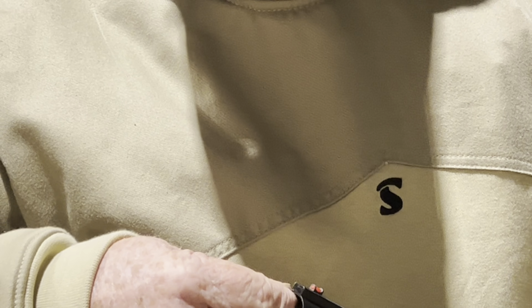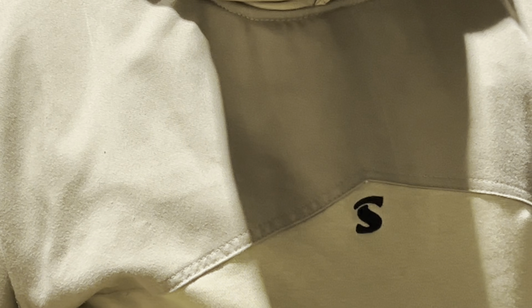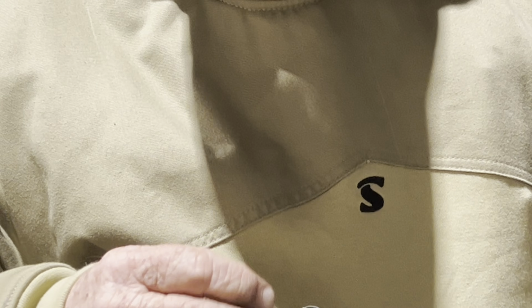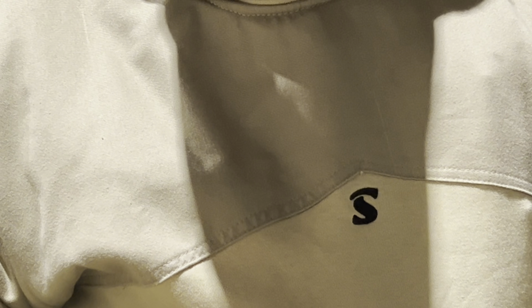We thinned that thing down some, I believe, and collapsed it a little bit. Or at least thinned it down where it'd have room to move. And then took it and put our vice grips in the vise there where we could pull and twist on it. We had some seafoam penetrant that I sprayed down in there. Got it around there and got it lubed up a little bit, and she slid on out.